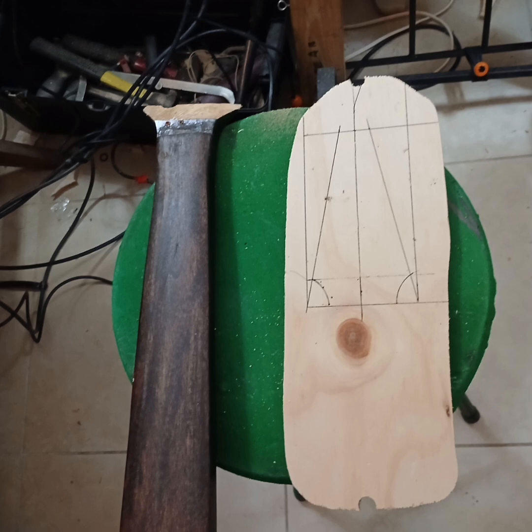Now in retrospect, I needed to go a little bit thicker than that. It could have stood to have something maybe at least an 1/8 inch thicker. I probably should have laminated something over the top so it was just a little bit stouter, because when I put the tuning mechanisms on there, it didn't screw all the way down flush to the surface of the headstock, which is not the biggest problem in the world, but it wasn't as neat as I'd like it to be, because when there's no tension on the tuners, they kind of rattle a little bit. When there's tension on there, they're fine. They're screwed securely on the back, but I'd prefer to have it tighter up against the surface. And so, live and learn. Headstocks need to be a little bit thicker than 1/2 inch.